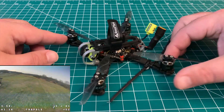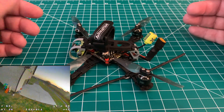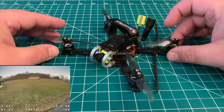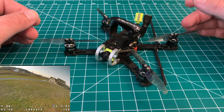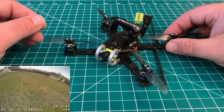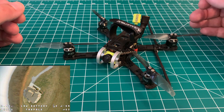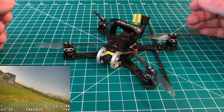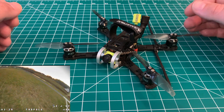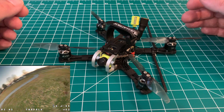After flashing that I updated to Betaflight 4.2.4 and loaded my VTX table. This is just a Happy Model whoop VTX, it's only 200 milliwatt — it is one of the weak links of this quad. I do have a Nameless RC DVR 400 milliwatt VTX that I'll probably be swapping in shortly, unless I go digital with this one using Shark Byte.